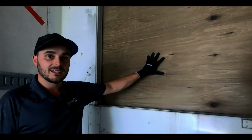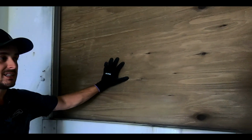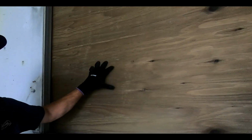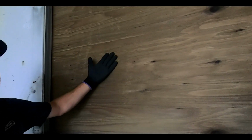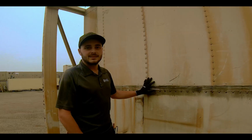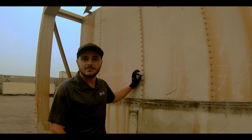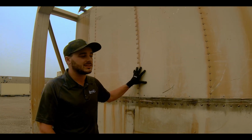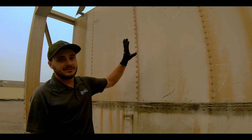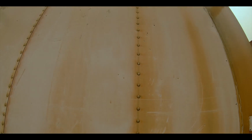If we were to modify this, often we like to take cutouts from other containers, the same wall system, and then fill this hole. That'll allow it to be aluminum on the back side, still give you the 2 inches of foam, and then that nice white FRP panel finish on the interior. This here is our favorite way to fill these reefer holes, but we're only able to do it when we have remnant cutouts from other overhead door installations. So with this, we have a panel from the side of a can. We've left a flange all the way around, drilled, riveted through there, and then silicone the perimeter.